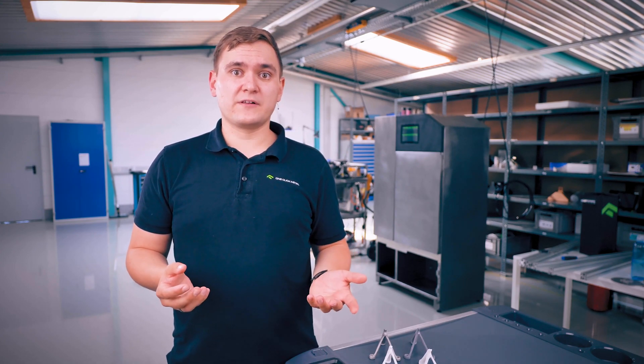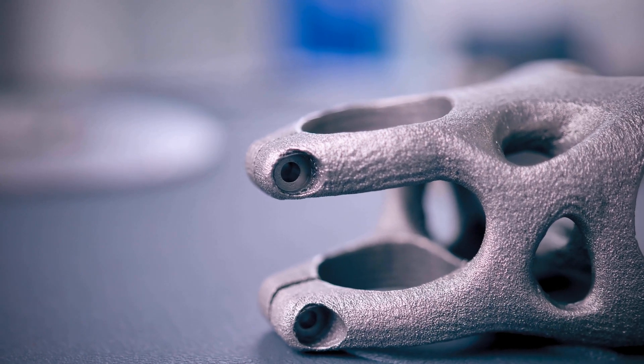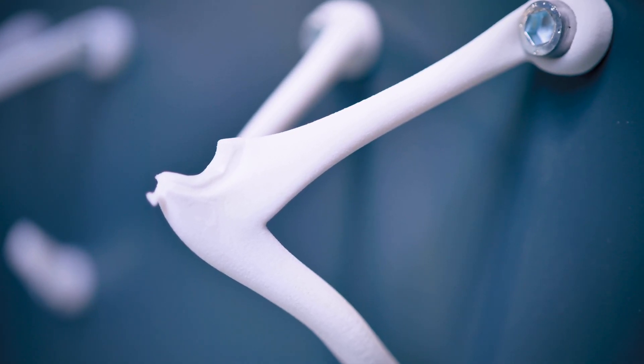It's the same process so far, but while laser powder bed fusion actually melts the powder into a tiny puddle, selective laser sintering just adds a small pop of energy that gets the powder particles to stick together. That works because the entire build volume is already heated nearly to the fusing temperature, and the laser only needs to add the last few joules to push it over the edge. The result is that LPBF creates parts that are over 99.9% solid — even better than a cast part — while SLS creates a thinner sponge that still contains considerable amounts of air between the fused particles.